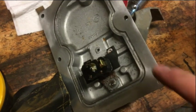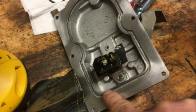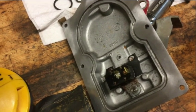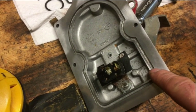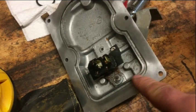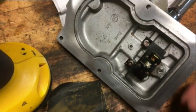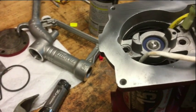What I'd forgot yesterday was the desiccant pillows that you can just drop in here - they will absorb moisture. When I put these seals back together I'm going to put a little bit of RTV in here to help hamper any moisture infiltration. Because once you start getting a little bit of pitting like that, I think it's difficult to keep it from ever happening again - it's actually penetrated the metal. So I'm going to try to slow that down by enhancing the sealing capabilities beyond just the gaskets.